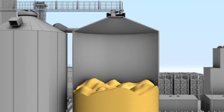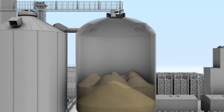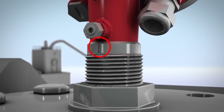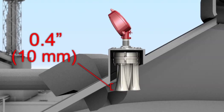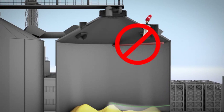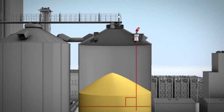In choosing the proper location, you should consider every aspect of the vessel and type of materials being stored. The 3D Level Scanner needs to be directed towards the center of the vessel. If mounting with a standpipe, leave at least 10 mm for the antenna to stick out. Make sure that nothing is interfering with the acoustic beam. The scanner should be located with a clear line of sight to the material high point, and the horn antenna positioned at a 90 degree angle from the ground.